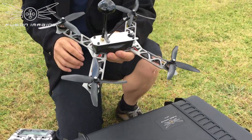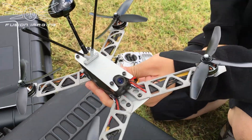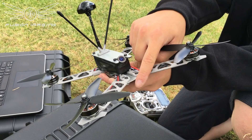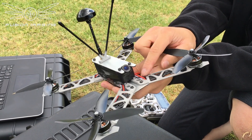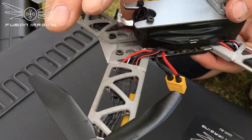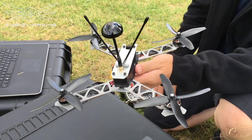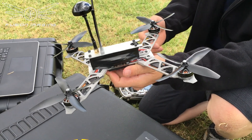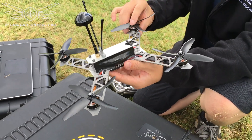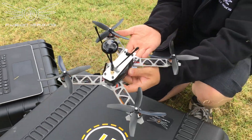You can see the camera and the main components have been moved back a little. I found that in a crash, it's the top edge that usually takes the impact. So if we can work the probabilities a bit better to contact the bottom as well as the top edge, it might be better — the bottom is stronger. These arms are pretty long; they can swing 7-inch props if one wants to. My personal craft have been 5 or 6, like most people's, but I started to realize that if the thrusting disc areas are further apart, for very high rates, rolls are more of a roll rather than a jump, due to the total thrust area being too close to the other side.